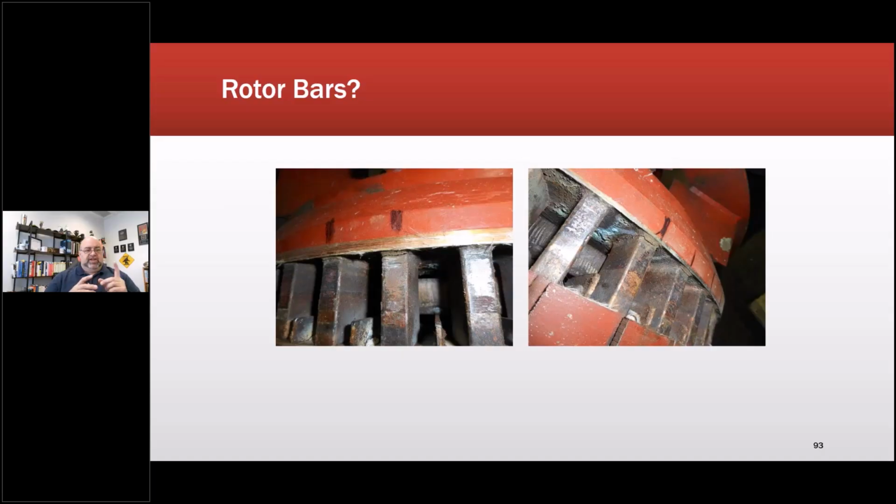What you're doing is looking to see if PD exists at fast rise time impulses, just like in a VFD. So you're seeing if it's possible to end up with PD, and you want any PD to show up above the voltage rating of the machine, just like doing an offline PD. But that again would be with a nice clean sine wave, right?